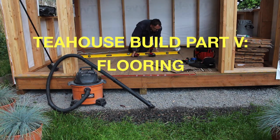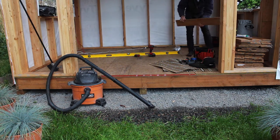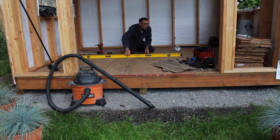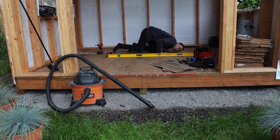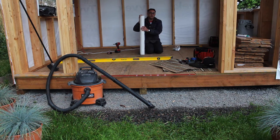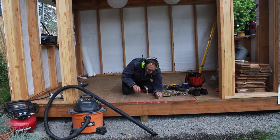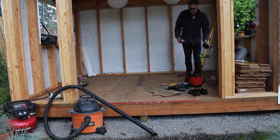It's time to start the floors. We've got this bamboo flooring, and I'm just making sure that the floor is flat enough — we don't want more than 3/16 inch variance. Right here we may have just a little bit more than that, so I'm going to add an extra layer or two of underlayment to build the floor up there. You want to leave the flooring in the room for about a week beforehand so it can acclimate.